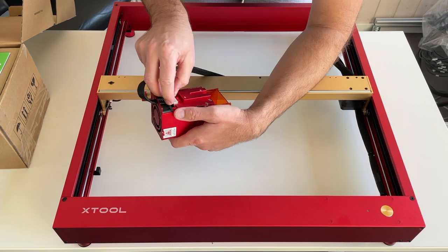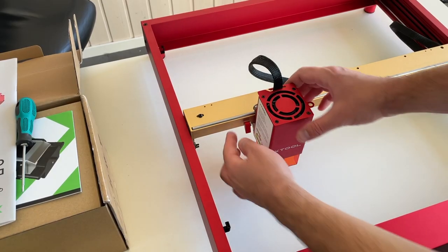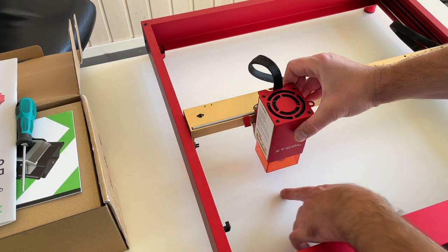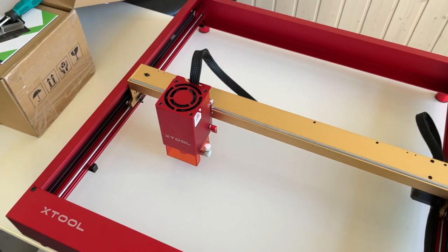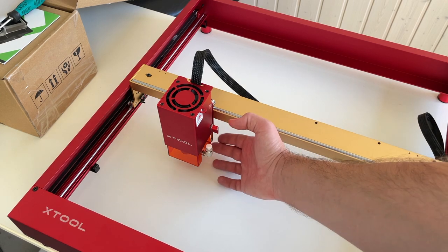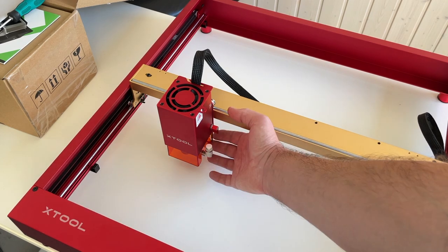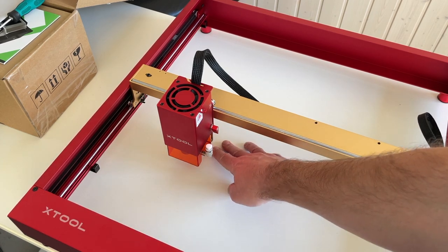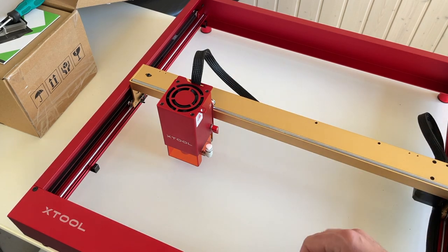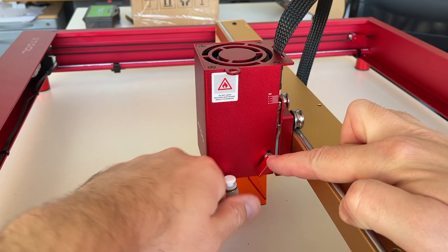The connector goes at the back and it's installed easily. Over here there is a lever — you can pull this lever and change the distance between the laser and your material. From this side there is a piece in order to focus your laser. This piece measures the distance between the laser and your material. So if this piece just touches your material, it means the laser is at the right height. And over here there is another lever with which you can fine-tune the focus of your laser.